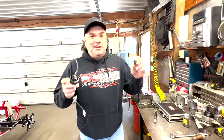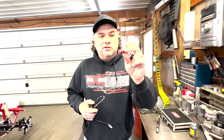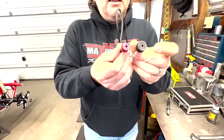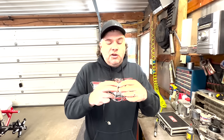I just want to jump in and tell you what the difference is between these bleeders — I'm sure you're watching and wondering why you'd use one versus the other. So the original quick-change bleeder was this red one — same internals as the black one but smaller in diameter and it has one spring. So there really wasn't much adjustment with this as far as changing the pressure — you had one spring to pick from and you're pretty much in that box. Which was okay, it did the job. Then they came out with this dual spring quick-change bleeder, which was a little more accurate. As Seth showed, the pop-off diaphragm was pretty large in diameter, giving you a bigger footprint — more accurate for sure than the red one.